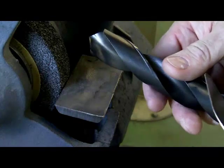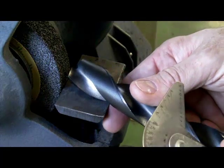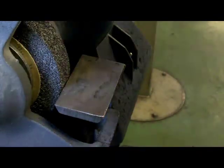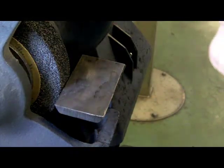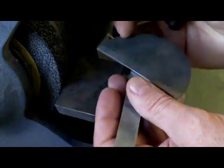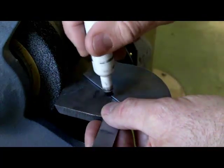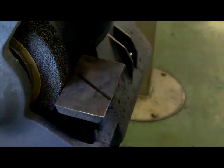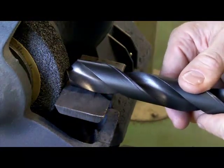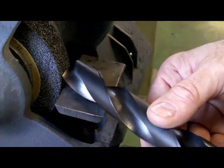When we start using the drill, we want to hold it off at half of the included angle. I'm going to come over to the face straight on and then move it off half of 118 degrees, which is 59 degrees. A trick you can use to set your grinder up is to take a protractor set at 59 degrees, just set it on the tool post, take a marker and make a line — which you'll erase later — that gives me approximately the angle I want to hold the drill off of center. So if we come over and hold the drill into center, I'm going to get it fairly close to that line; it's just going to give me a guide.